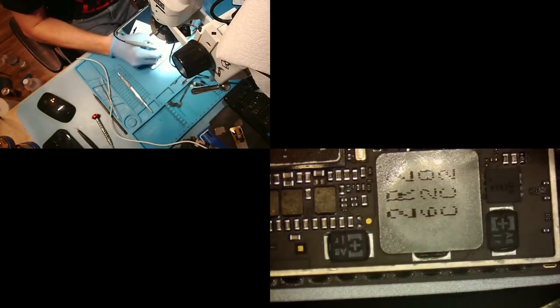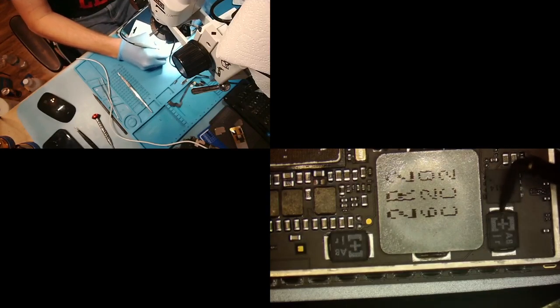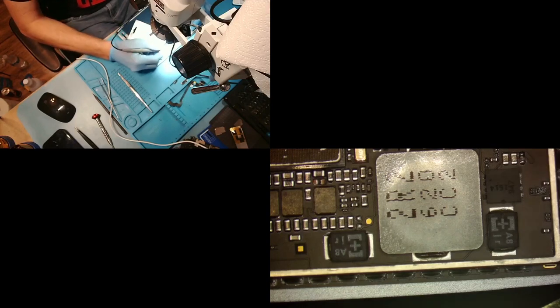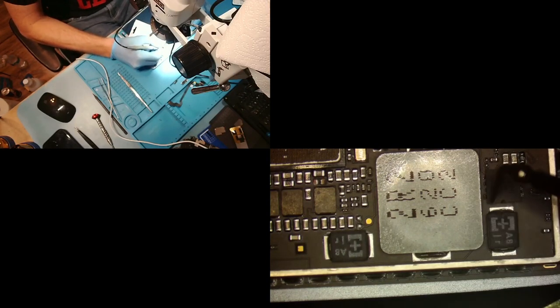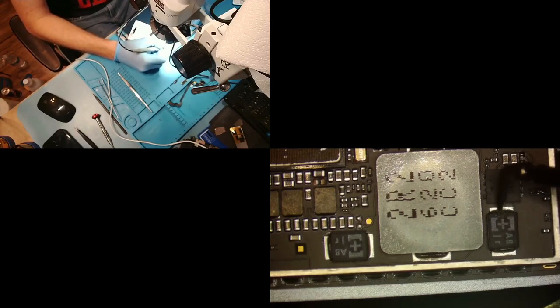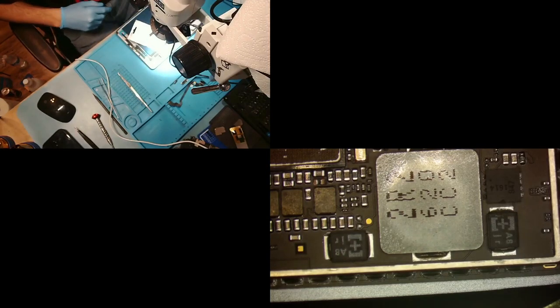All right, so now our multimeter probes are back on the multimeter, and we can go ahead and probe the main cap again. And we have the sweet sound of silence. No shorts, right? So this is the sound of a short over here. Bad, bad, bad. And good, good, good, right? So we should be good to go. This iPad should be repaired.